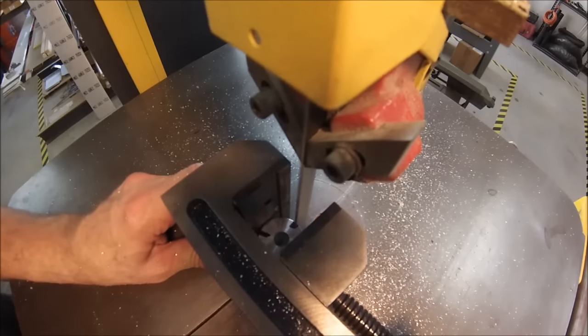The good thing about this is if you have the relief cuts in your collar and you blow the hole, put a smaller shim in, squeeze it a little bit tighter, and do it again — you can use the same one. The same principle holds if you want to use a bigger diameter part in that same collar, so long as you don't wipe out the edges or the webs that keep the thing with any kind of spring integrity intact. You can continue to bore it. It's all a matter of how strong you are, how strong your chuck is, how tight you want to do it, what your part looks like — a dozen different variables. This is a good trick. I have about a thousand of these bushings laying around for all different sizes — little work, big work, whatever. If you like it and it takes the slop out of your job and you're thrilled with what you got, leave me a comment below. If there's something you still don't understand or you have a suggestion on how to improve this, write that down as well. So until my next video — Joe Piszinski, Advanced Innovations, Austin, Texas. I'm out.